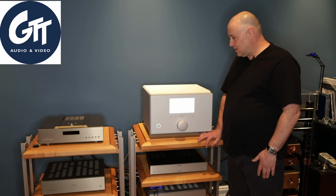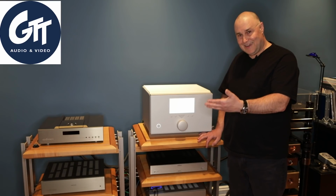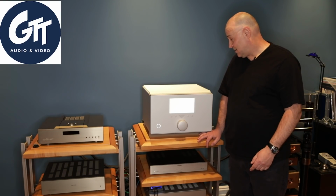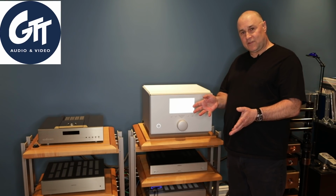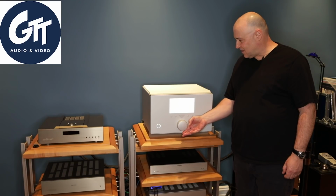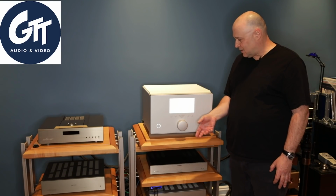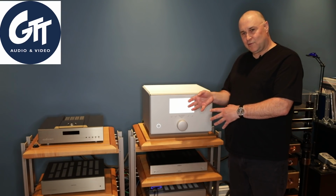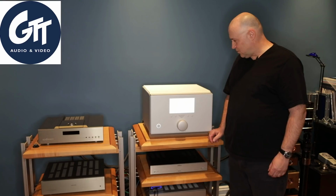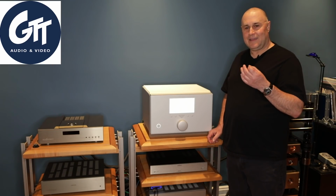There's nothing like it. They've upped the bandwidth to 2.2 megahertz. Still kept the natural output impedance at 22 ohms. That's not corrected. I make a big point of that. All the boards are galvanically isolated through optocouplers. You got a double ball bearing volume control that is optically coupled to an analog resistor network. It's pure analog all the way through. What this does, words cannot express.